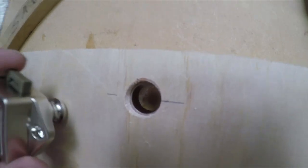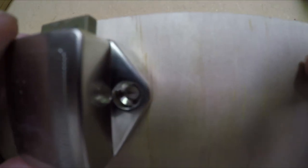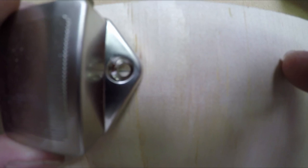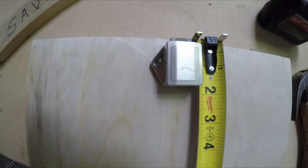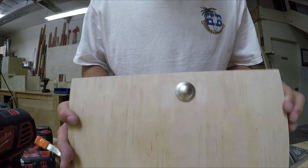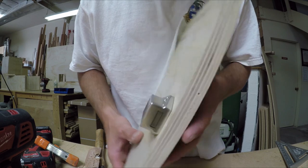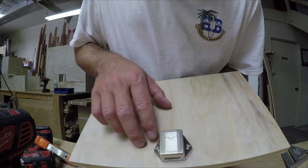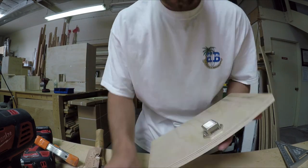Now let me show you what this little line is for. Put the little catch in. You want to keep this thing as straight as possible, and that's what the line is for. If you can see down through there, right there is my line in the middle, and right over here you can barely see the line as well — it's just a reference to keep this thing straight. You don't want it tweaked either way. You can also take the measuring tape and measure each side, but the line is a little easier. Screws are in, nice and clean looking. One thing I want to say: don't tighten these too tight, just snug them up. I've had problems where I tighten them too much and the little push part does not push very easily.